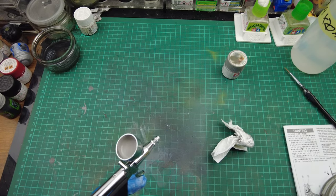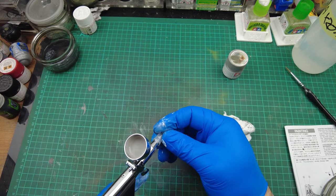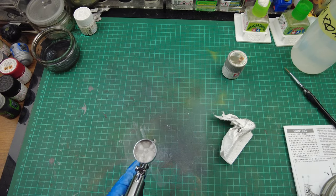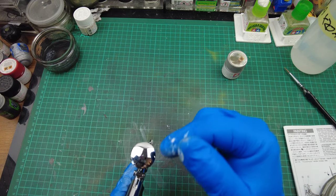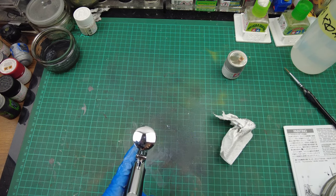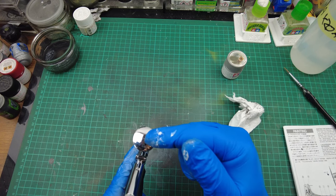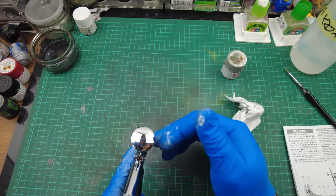Slip the rubber cover on and with a bit of back-flow that will mix the thinner and paint at the end of the nozzle, then put the lid over to avoid any further spills. It's very important — there's a hole in the top of the lid that must be kept clear at all times. As you spray, a vacuum forms drawing paint out of the colour cup down through the nozzle. If the hole is blocked, the vacuum can't form and you'll get no paint flow.